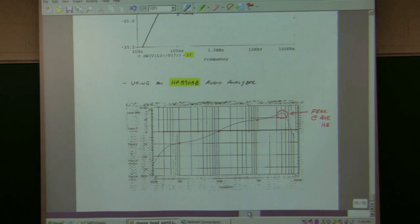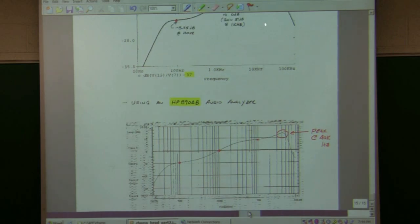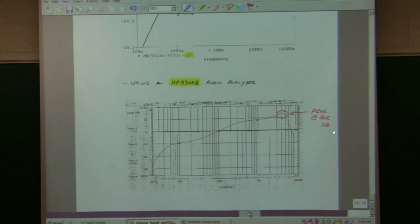Where this is coming from, because I modeled the tubes pretty carefully, is the output transformer. I just have an inductor and a resistor in the model, but there is some capacitance, and it resonates with that inductor, and I'm guessing that's probably where that's coming from. So the next thing I want to look at is to measure the transformer, but measure it out at higher frequencies and see whether to include some more stuff in the model. I know that others have done this and added some capacitance. And I'm trying to get the simulation and the models to agree.